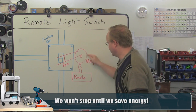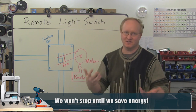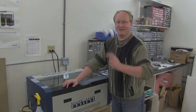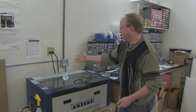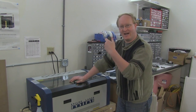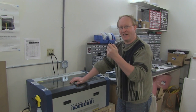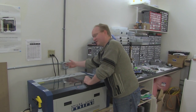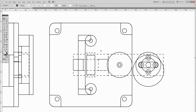So you push a button, beep, it rotates, flips up; push it again, beep, rotates, flips down, turns the lights off. This is the light switch that controls our additional overhead lights that we use for filming — it has its own breaker and is basically dedicated. We want to make it easy to use so you don't forget, so I'm thinking we tie a remote car key fob into it. You just hit a button and it toggles the lights on and off mechanically. We need to make some sort of switcher lever that does that — we want to flip the light switch mechanically.